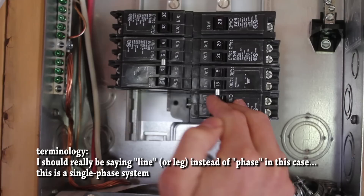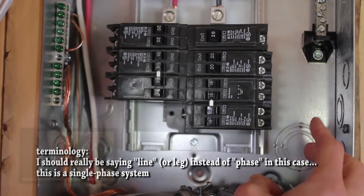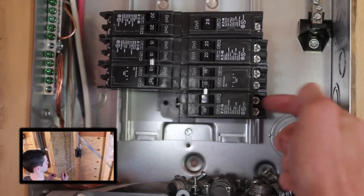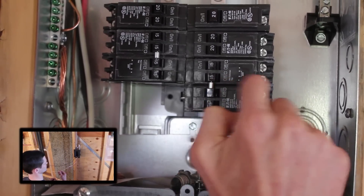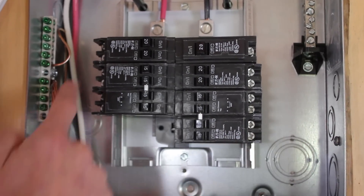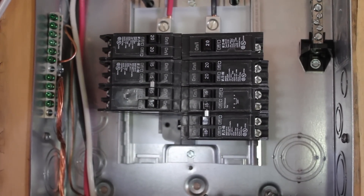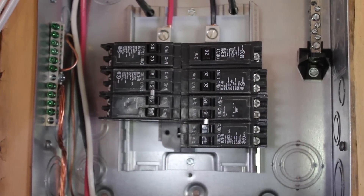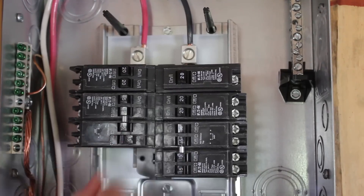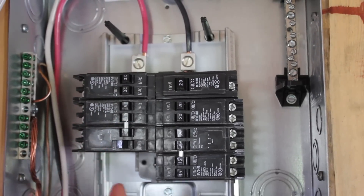For the 15s, you can see how this is tied together across two slots — this is all one big chunk. These are fused together; it's like a double wide breaker. Each row is alternating phases: phase one, phase two, phase one, phase two. The tie in the center is a way of spanning the two different phases. There are a couple runs where we have a three-wire that has two circuits coming off it, and we had to make sure they were on separate phases — putting the red wire and the black wire of that three-wire across this divider. If we put both on the same phase, it could create a dangerous amount of current flowing. Also, new breakers should always come in the tripped position, and you'll have to turn them off and then on to use them. If they're fresh out of the box, they should always be in the tripped position — that's an indication they're new and unused.